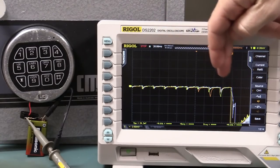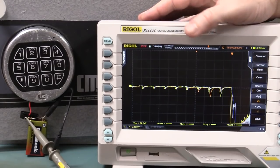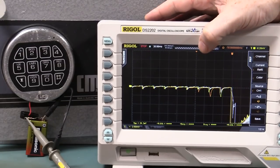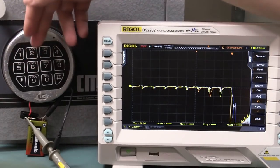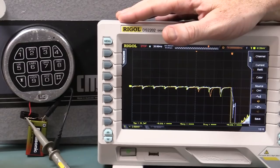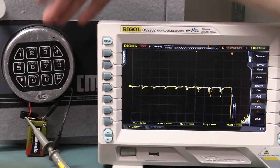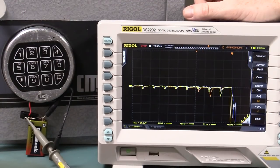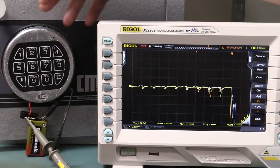So yeah, we found a couple of interesting things there, and there might be some sort of vulnerability there, but it doesn't seem consistent, which is really annoying. And as I said, even if there was a vulnerability there, go through the math of how many attempts you'd need if you had to do the whole six digits, with the three attempt, 10 minute lockout. So you'd have to do it some other way. So I think the simplistic approach I've been doing seems reasonably safe, pun intended. But no, it doesn't mean this thing is not vulnerable.